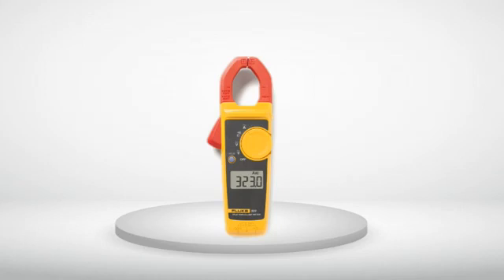It's a Fluke — built like a brick, works perfectly, and has a great design. Fantastic tool for measuring current without breaking into the circuit. Remember, you can't measure current by clamping an extension cord or a piece of Romex — current running out the black and back on the white will cancel each other out. You have to expose one wire to clamp that one to get a real current reading.